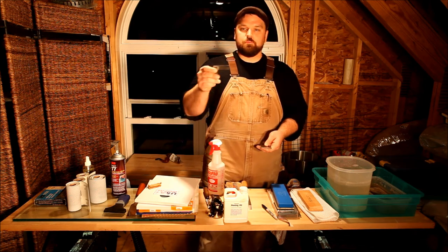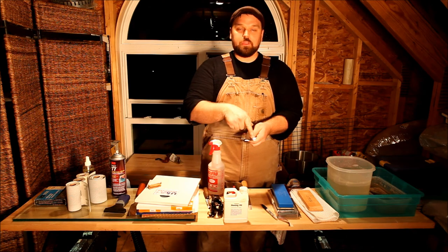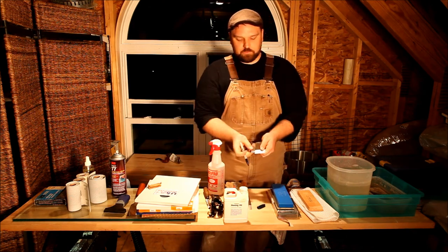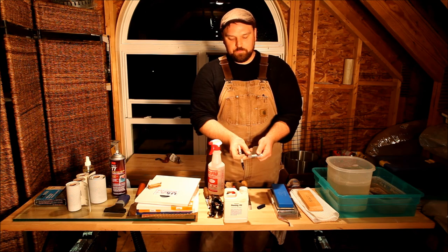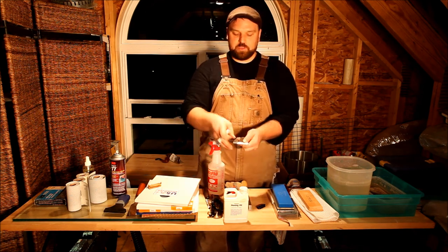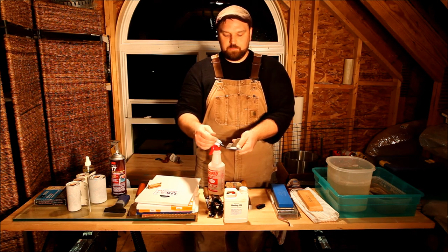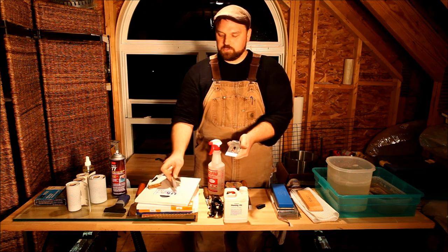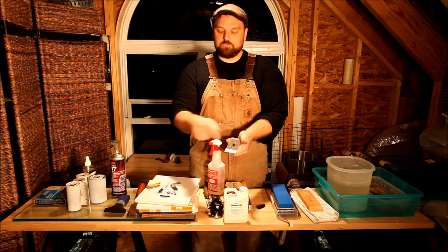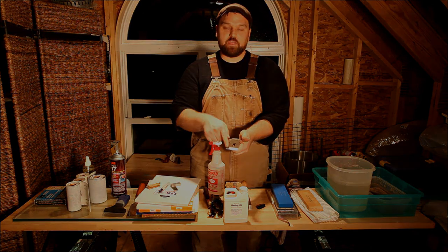I've got this miniature try square, which works great. If I put some nicks in the edge of a plane iron, I go across and first check the squareness of my tool, then take it to the grinder and peel off the edge — say I've managed to snag a nail I didn't properly check for. I put the square on there and strike a line across, so now I know where I've got to grind to. I've got a flat reference surface referenced off the tool and I can grind right to that edge.